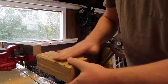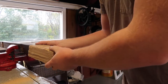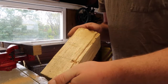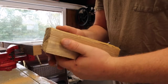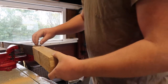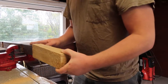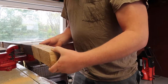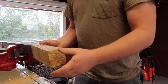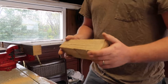This is a piece of sugar maple that I have had laying around. It is pretty square already and definitely big enough to use here, so that is what we are going to use. I am going to flatten off these two faces with the wood plane and make the whole thing square and the right size. When we mount this, we are going to do a mortise and tenon — it is going to come in through here up into the good wood by about an inch to an inch and a half. Then we will drive two pegs through there to hold it in place, and it will be a really nice solid repair when we are all done.